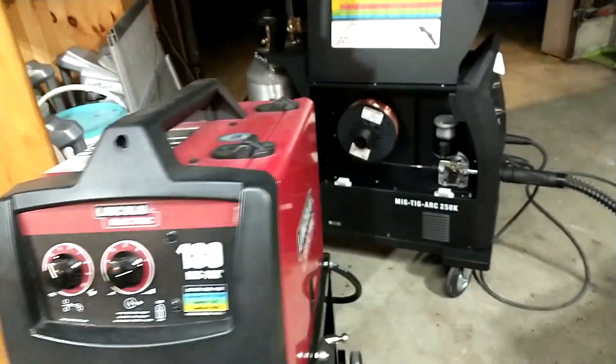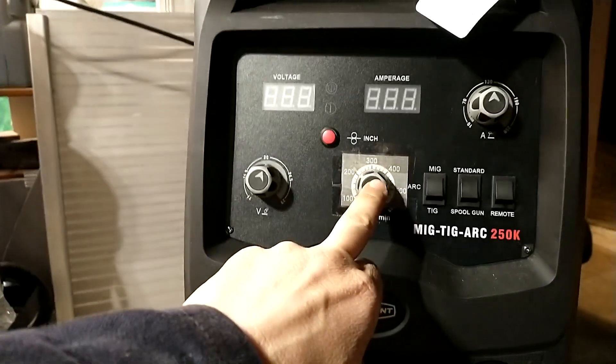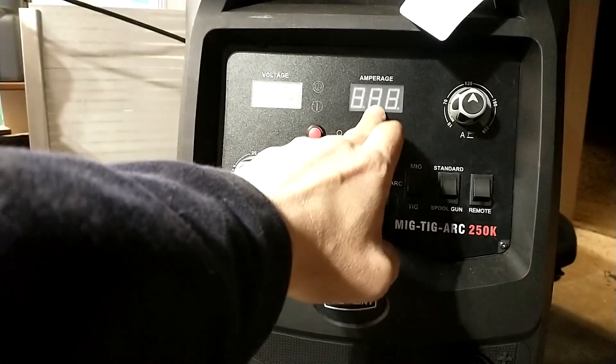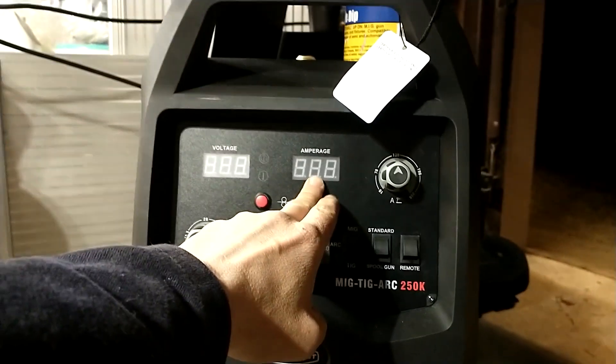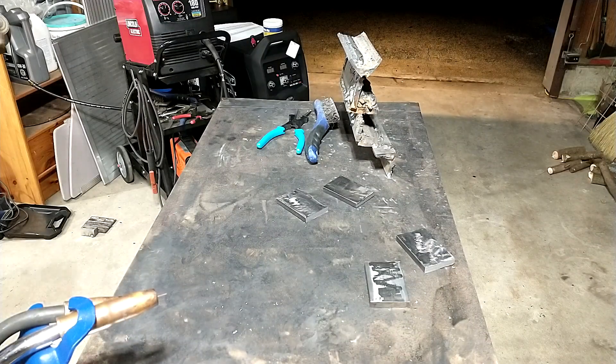And for the big machine, it's not going to display everything right now — about 23.5 volts, 550 inches a minute. We're going to take a reading of the current on here because when you weld with this machine, it displays the amps. Okay, so we're ready to go.